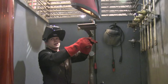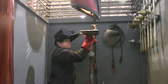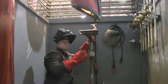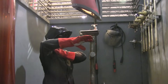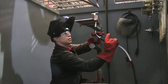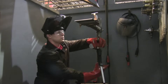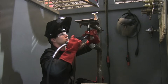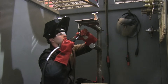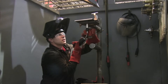Andrew was going to talk through positioning and gun-hold advice, but there was too much background noise. Height is very important — just because it's overhead doesn't mean it has to be over your head. You've got to be somewhere comfortable with a good line of sight. Practice how to hold the gun; there's no hard and fast method. You can turn it sideways and run the trigger with your index finger if that works better. Do a bunch of dry runs and figure out what works before you get hung up.